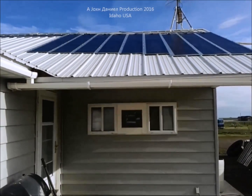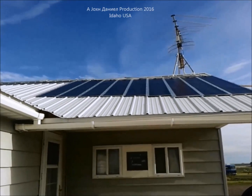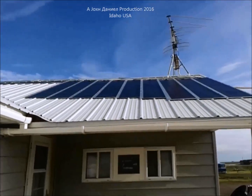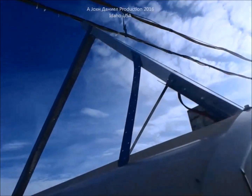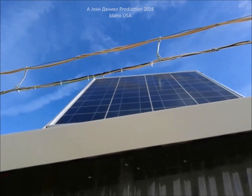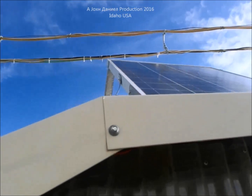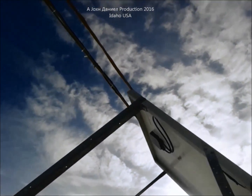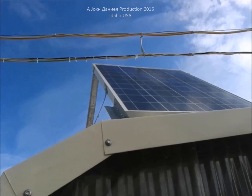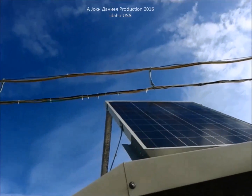This is the whole point of amorphous solar - I want everybody to understand that amorphous will give you five to eight more literal hours of charging. So do you need twice as many batteries with a bunch of cheap solar panels, or do you want something like that? The panel out here is just now putting out about 20 percent of its rating - it's a regular panel. Compare that to an amorphous panel. The wires on the top of this panel are way behind it and never interfere, and the panel is on a winter angle. I hope that helps out. The amorphous panels on the roof versus the polycrystalline out here - there is really no comparison.